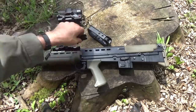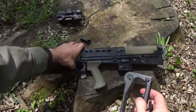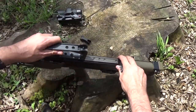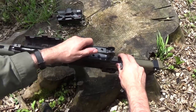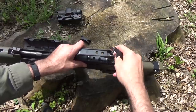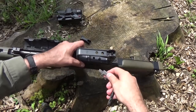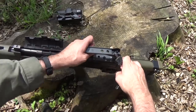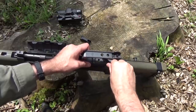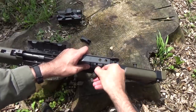So what we're going to do to fit this is, instead of a little plunger, what you've got here is a screw that has to be indexed, and there are three possible attachment points to give eye relief, and you want at least 25 millimeters eye relief. Now I shot back in the day, I shot the Cadet GP rifle quite often in competition, and that had a different rear sight. It's otherwise the same system, but there was no tritium element, and the L position flip had a battle sight that was more squared off, and then in theory, I think it was 200, 300, 400, 500, 600 meters on a little turny wheel there, but we weren't convinced that they actually did anything. So what I'm going to do is put this on the mid position. You might be thinking, well, the sight radius is going to be different depending on which point that's in, and you'd be right, it varies between 290 and 320 millimeters. Not that it makes much of a difference.